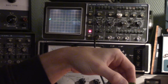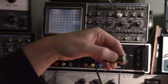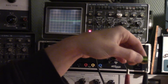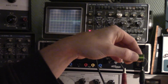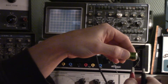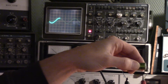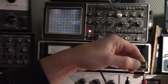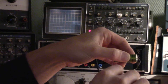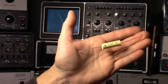As we can see on the oscilloscope, we have about 4 or 5 millivolts peak to peak. Now we will reverse the polarity. So now as you can see, there is almost no measurable noise at all. Let's swap it back one more time. So what you're seeing on the oscilloscope is 50 Hz picked up by me as an antenna and coupled to the capacitor. And when the outermost foil is connected to ground, it is much less noise sensitive.